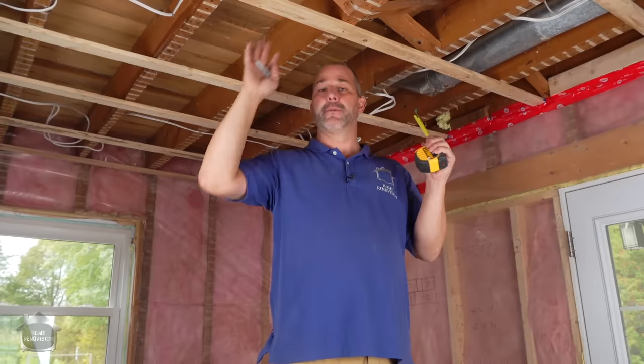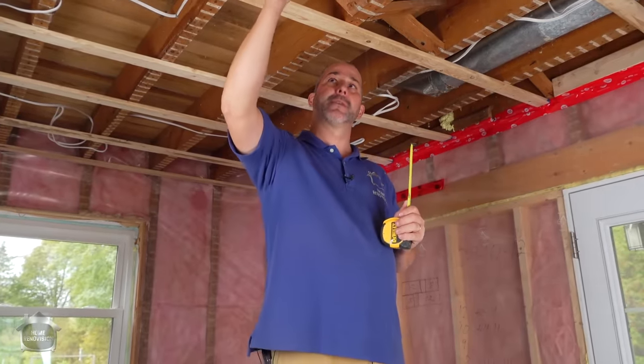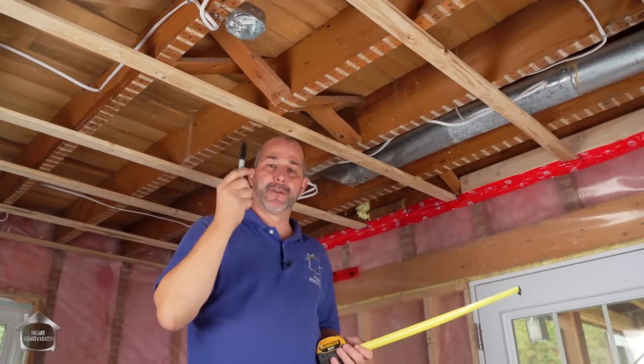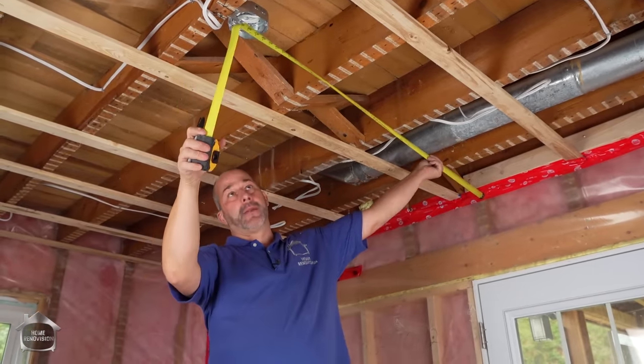The drywall is square, your cutting might not be straight. There's so many variables that leaving all of the cutouts until after it's installed is your best bet. So what you want to do is measure the center mark of this fixture, center line, and write it on your plastic wall. You can't drywall without a marker, I'm telling you right now. This is like the most important tool.